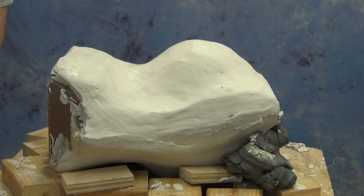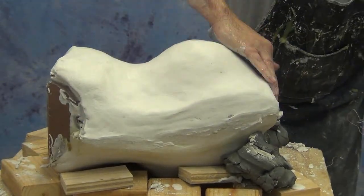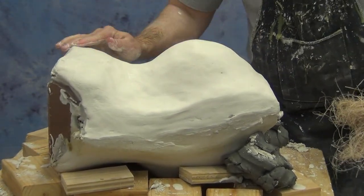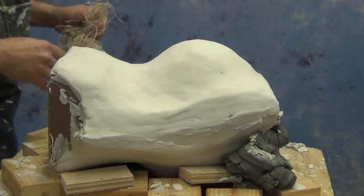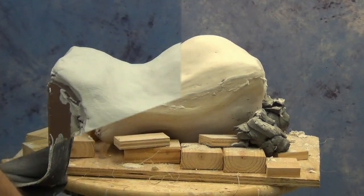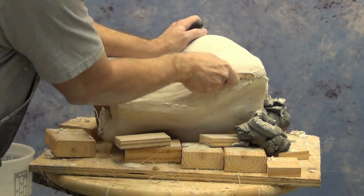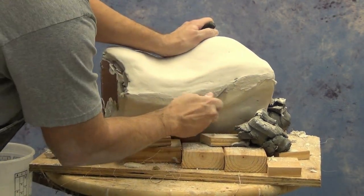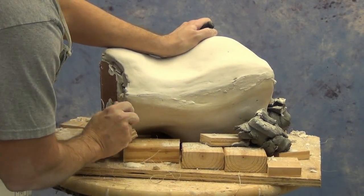And there we have our second half, and again, we just polish that up with some hemp, and we have a nice, clean Hydrocal mold. And again, we're ready for that to go through its hot stage and then cold stage. And again, the way that works is it goes through a temperature spike where it gets really hot, and you'll actually see steam coming off the mold at that stage. And then it'll drop down and actually get cool to the touch and then level out at room temperature.